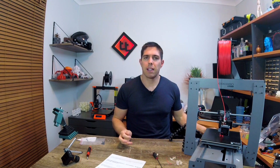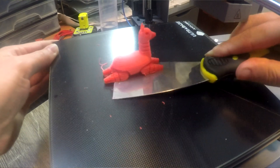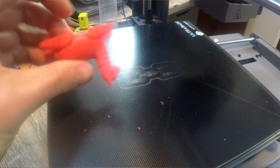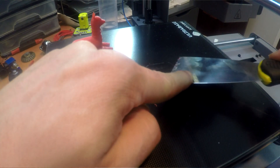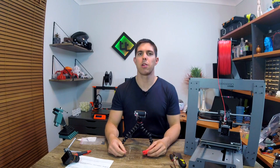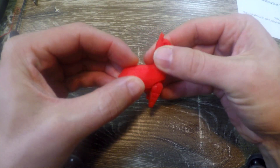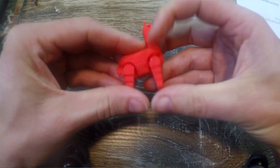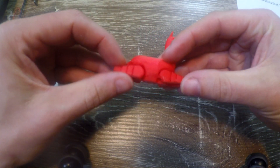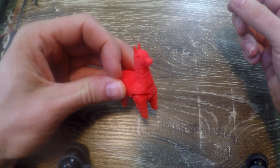Okay, we have a fail — at least partially — in the fact that I'm going to need to use a spatula. I'm not really happy about all of this being left behind; this is the exact thing I was trying to avoid by getting this. This is the worst print I've done on this printer for a while — I seem to have some under-extrusion, though I can't really blame that on the bed. It's got a lot of separation between the layers, it sounds flimsy and like it wants to fall apart. The only good news is it did actually print properly in terms of its articulation — printing one piece with gaps in between — and you pull it off and it snapped into life instantly.